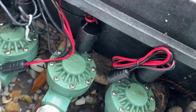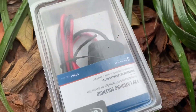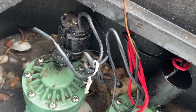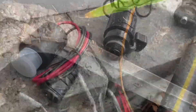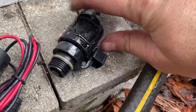So right now, I'm in the middle of converting my solenoids over to DC, which is that red and black wire. Those are the solenoids, which are here. And these are the old-style Orbit valves that have the smaller diameter thread. I'll explain that in the next clip. But the first thing you got to do is take the old valve out. Okay, so you can see here, this is what the solenoid looks like when it's removed out of the existing Orbit valve.